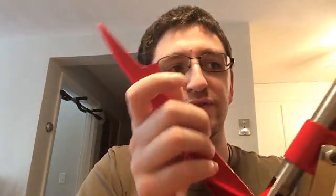I just wanted to close with a few notes on efficiency and safety with this process. So even if you have the quick die change, you're probably going to want to set up your process so you do one step to a large number of rounds, and then move on to your next die and your next die and your next die. It's not conducive to doing small batches, because you have to do a small batch, change the die, do it again, do it again, do it again.